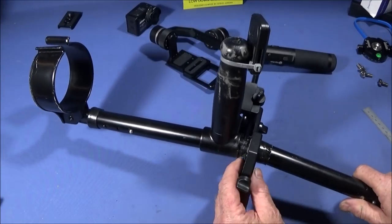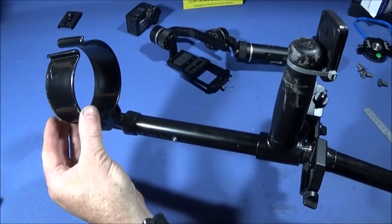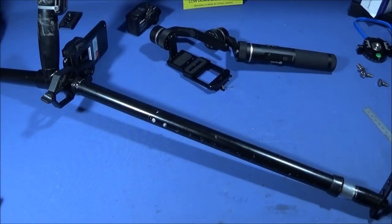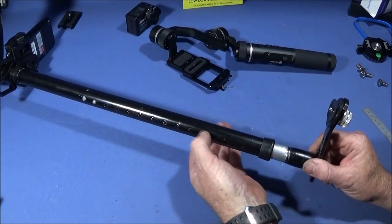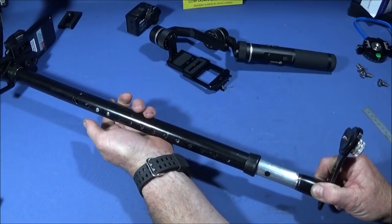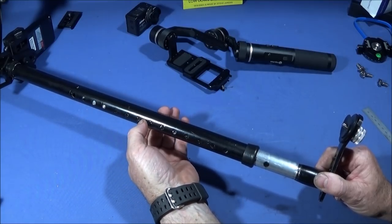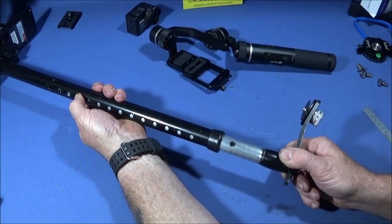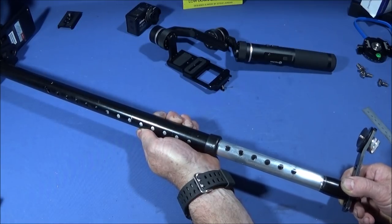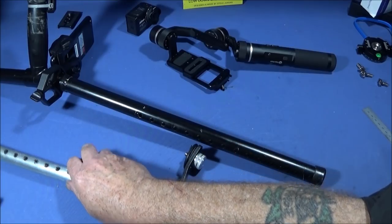And because the rig is made out of an elbow crutch, like I said earlier, you have all the different adjustment. You have three holes on the top here, so you can extend the elbow clamp part there, or the rest, so you can take it up higher. And then you have 13 holes down the diameter here for adjustment, so you can extend the rig, which is excellent. If you want to move the extension quickly without it clicking into each different hole, you depress these buttons here and then turn the assembly like that, and then you can pull it all the way down without those buttons clipping home into those holes. And you can even pull it right out so that you can put it in a case or whatever for transportation.